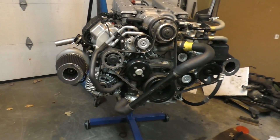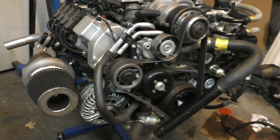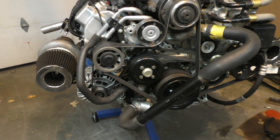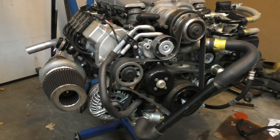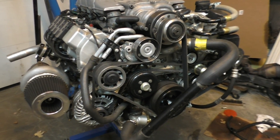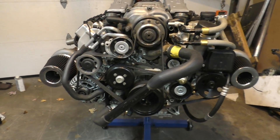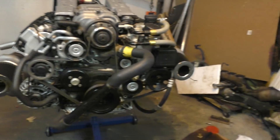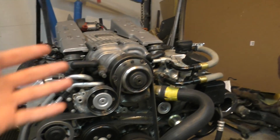That's going to be everything for this video. Coming up in the next few weeks: I've measured out the turbos and confirmed they'll fit in the frame, so next I have to take the E55 apart from the rear and measure out the differential — that's the last thing I need to check — and then I'll start work on the frame and building the new project. If you have no idea what I'm talking about, watch the previous video explaining the new project: placing turbos on the side, getting rid of the supercharger, and doing a lot of work on the induction side.